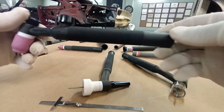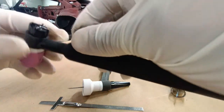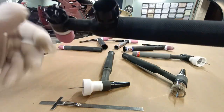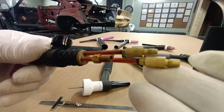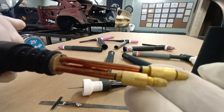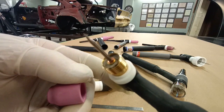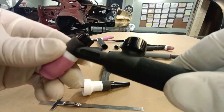Next up, we have a number 20. You see the V at the end of that — that denotes 'valve.' In this particular torch, you control the gas flow on and off with a valve. Pulling the handle off, you have a coolant inlet and outlet and then a gas connection. This torch is rated at 250 amps, and this is a gas lens with a stubby back cap.